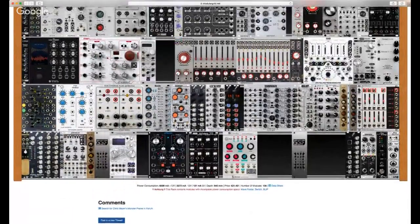Yeah, I got to hear those again yesterday at Ross Lamon's Bells and Whistles, Crackles and Pops event. Alan from AJH came up. That phaser's gorgeous. It really, really is. There's a cool trick with that for anyone watching that doesn't know. You can tap the feedback from any pole; it doesn't have to be the one you're listening to. So you can set up a 10-pole or 12-pole phaser, but tap the feedback from pole 5 or 3 or 7.